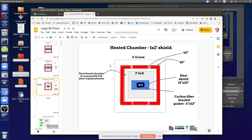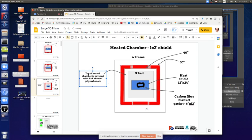You've got two sides of metal. I think that's just fine, honestly. I mean, if worst comes to worst, you can screw a block in the middle so that it makes it a little bit more rigid. You get what I'm saying? Yeah. Like, you've got the whole height of it, and you have just 2x4 up here, and a sill plate and a head plate. Like, you've got that whole section, it's maybe a little flappy. I mean, you can put just one block in the middle, which will hold it.